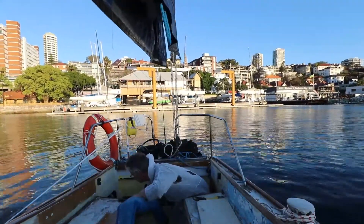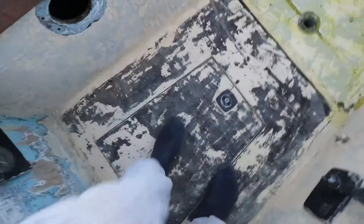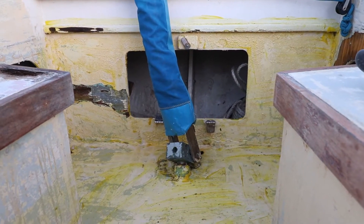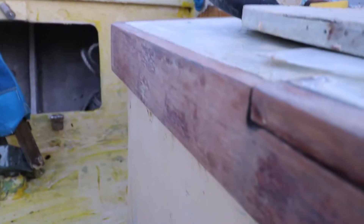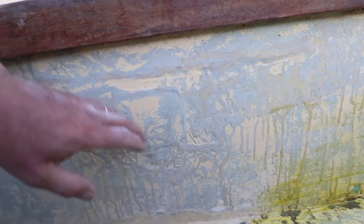So we have a good sanded floor here. The paint is coming off with another coat of lemon peel, and you can see it working particularly well up the back there now. Close up — lemon peel. Then we have to sand all these, and maybe lemon peel them back to timber so that they can get a coat of boat coat.